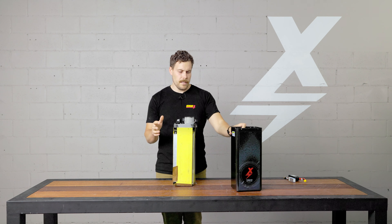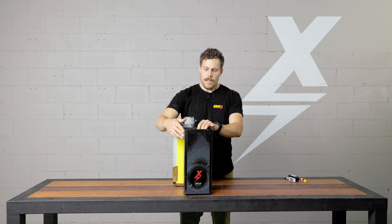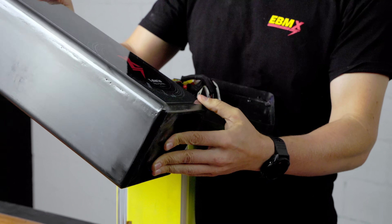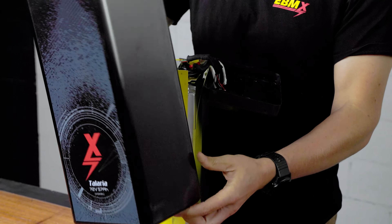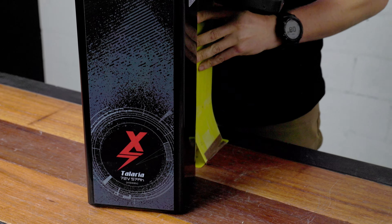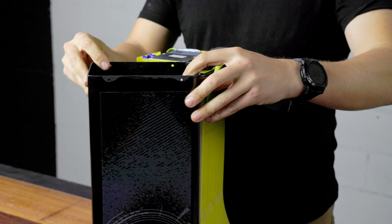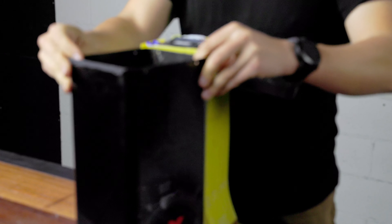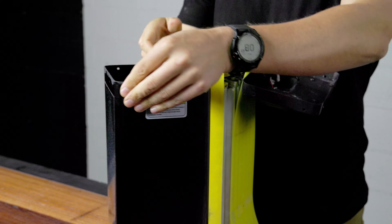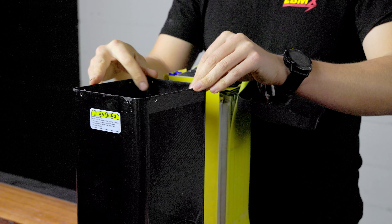The case itself is stainless steel — it's seam welded down the side and the bottom is tapered to fit into the bikes and sit right down in where it needs to. Because it is welding, when you heat metal and it cools down, sometimes it deforms or deflects a little bit. So if you get a battery and it feels like it rocks a bit, or it doesn't look perfectly straight on the side, it doesn't mean you have swollen cells in your battery.